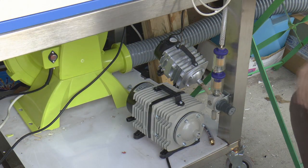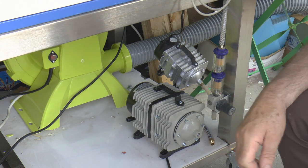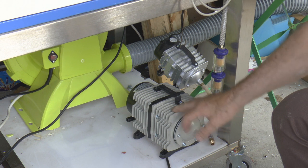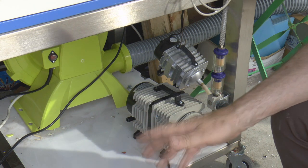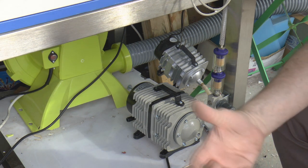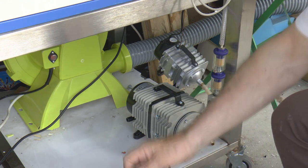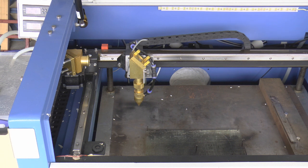Just underneath here I've purchased a bigger air assist pump. It delivers about 10 times as much flow, but by the time you force it down the pipework you can only get about twice as much flow through the nozzle. This current one has been working for a year and seems a little labored now, so I've got the new one ready. In the not too distant future there'll be a video of me fitting and testing it as part of improving the general performance of this machine.